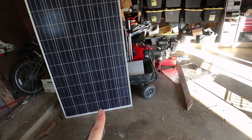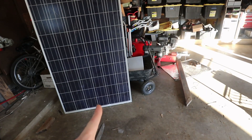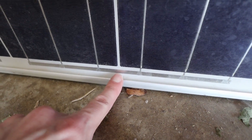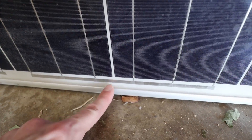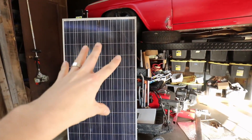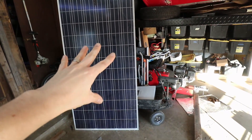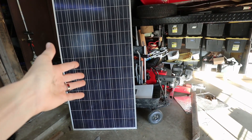What I ended up doing was cutting out a piece on the back of the panel to get access to the tab right in there. I cut the back of the panel open, got access to that tab, and cut the tab in half so I can connect onto one side for one end and the other side for the other end. What I've essentially done is created two 20-to-24 volt panels — the 46 volt open circuit divided by two is about 23 volts.